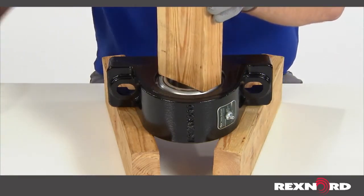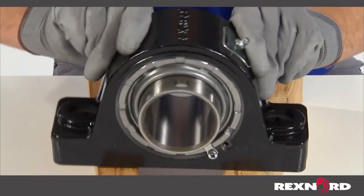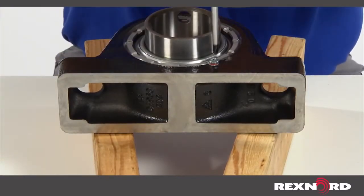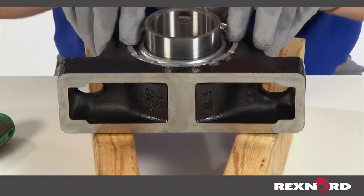This procedure is only required when increasing the clearance. Turn the bearing over and with the micro lock tab removed, try to rotate the threaded cover clockwise by hand. If the cover moves, return back to its adjusted position and repeat the previous procedure of striking the inner ring until the cover cannot be adjusted by hand.